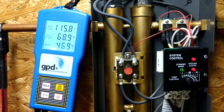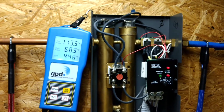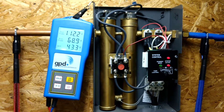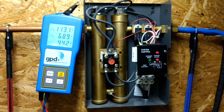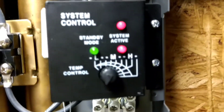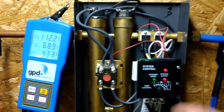So let's drop it as low as it'll possibly go, all the way down. You would think the temperature would just drop right down like a rock, but it looks like it's still trying to raise the temperature by at least 40 degrees. I don't know if this is a defect — maybe the temperature sensor is not working right, maybe the control board is bad, maybe it's not reading the temperature control knob input, or maybe this water heater just defaults to always raising the temperature at least 40 degrees. But I'm sure that's not the case.